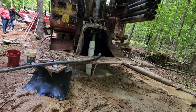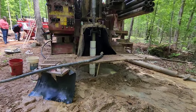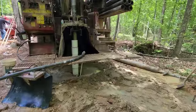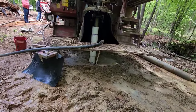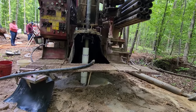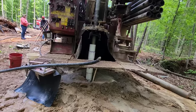So far it's been pretty much in time-lapse. When I run into sand, I really have to focus — there's a lot that can go wrong. The hole did collapse on me. We got in 60 feet of casing, and then we had to blow the hole. The bottom 20 feet filled in, so you couldn't get the casing in. I had to go inside and blow it out, blew the hole clean, and the 60 feet of casing fell to the bottom. You could look down the well with a flashlight and see where that coupling was.